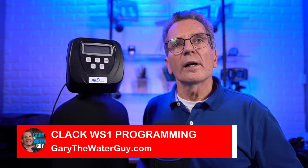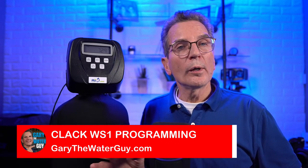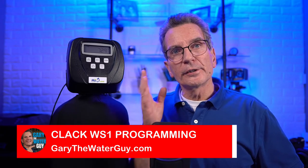Now, when it comes to regen time, again, if you're on well water and you have multiple pieces of equipment, like a water softener, an iron filter, a tannin filter, something like that, make sure that you're not regenerating them all at the same time. They can't all regenerate at 2 a.m. because you don't have enough water to properly regenerate each one if they're sharing that water. If you've only got 9 gallons per minute, in cottage country, that's fantastic, 9 gallons per minute. And you divide that by three, now each piece of equipment has only 3 gallons per minute to regenerate, and it won't regenerate properly.